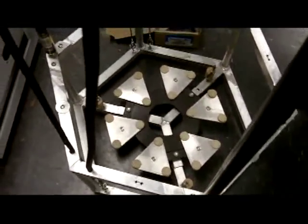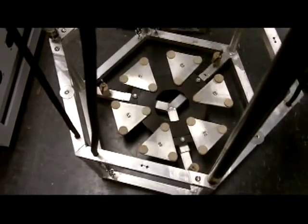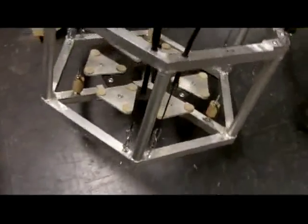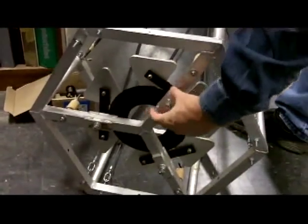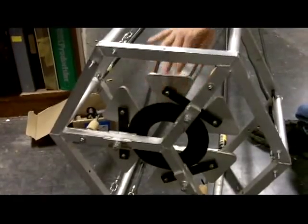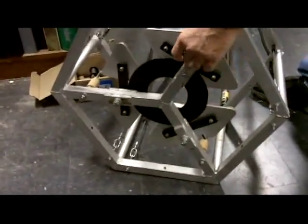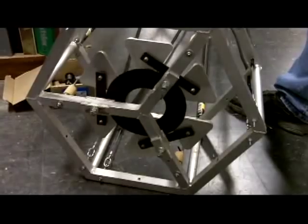So what I did was I took an existing 18-point cell that was built by Aurora Precision and essentially took it off of its back frame and built it into the lower cage itself. One of the things that I did in order to do that: you notice that there's extra pieces welded onto the aluminum here, where it mounts in, and that was done so that I could insert nut certs in here and have enough rigidity for it to work against.